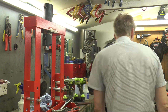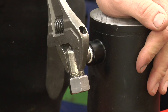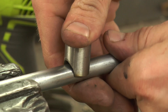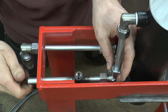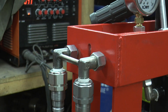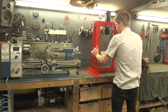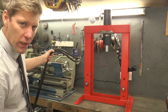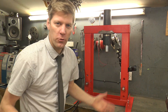We just need to do a bit of plumbing there. Got the hoses all clicked in, rigged up myself a temporary switch, so we'll just purge it. It might be a bit jittery to start off with, and once all the air's gone we'll try and press something.